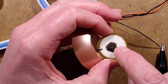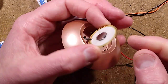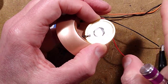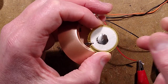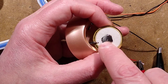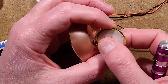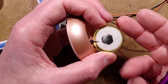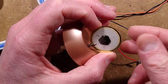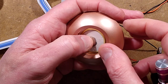These discs are also used as sensors. You'll find them in electronic drums, and in vandal-proof metal buttons where one of these discs is stuck to the back of the button - when you push it, it doesn't move, it just responds. The piezoelectric crystal is placed in a heated oven, brought above its Curie temperature, a voltage is applied across it, and then it's cooled down again. Once it goes below the Curie temperature, it kind of stores that electrical charge state, and that's the secret of it.